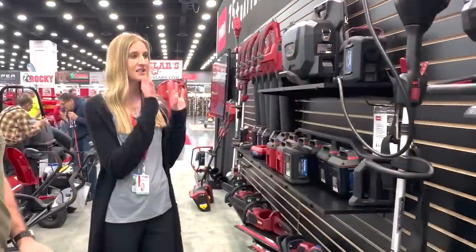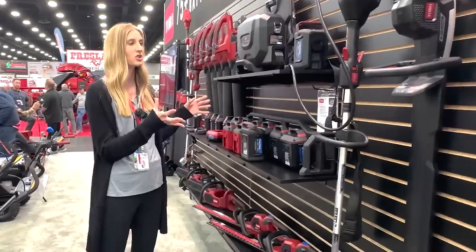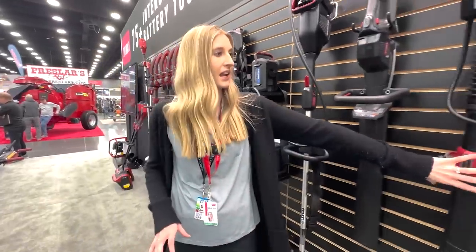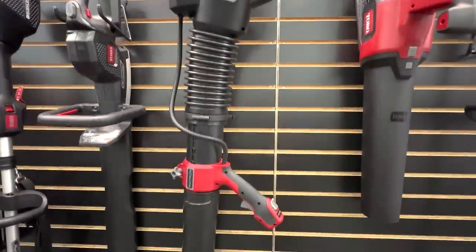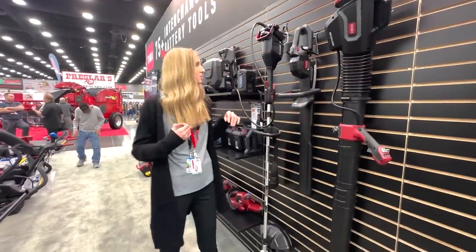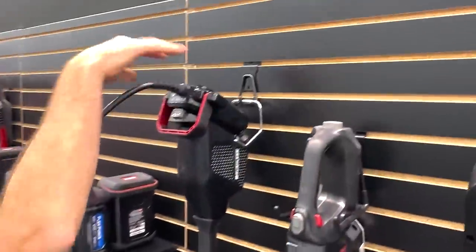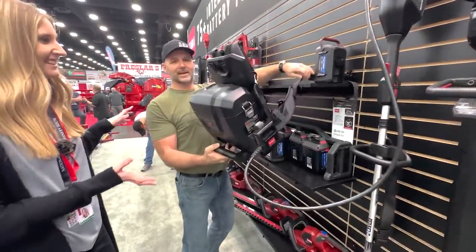So, Sarah, tell me about this. This is the brand new Revolution Professional Handheld Equipment — this is truly commercial grade. We've got our backpack here, which really serves as a power system for all of the tools. We've got our blower cannon here, so you can do a backpack blower. This is 730 CFM, 160 miles per hour if you're using two 10 amp hour batteries in the backpack. We also have the power link tether that connects right here to the backpack, which allows you to connect the string trimmer as well as the hedge trimmer to the backpack.